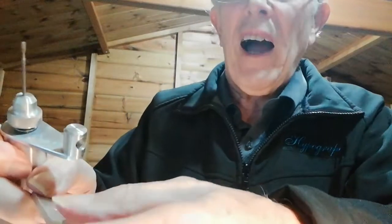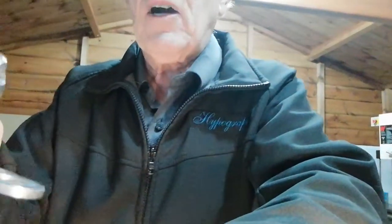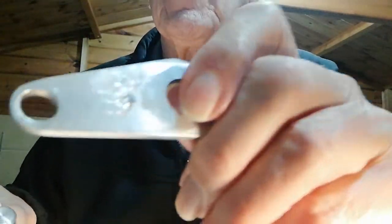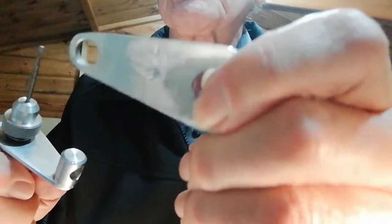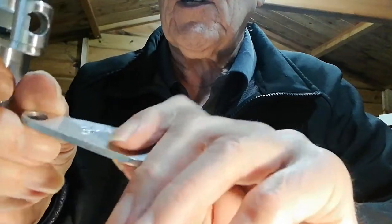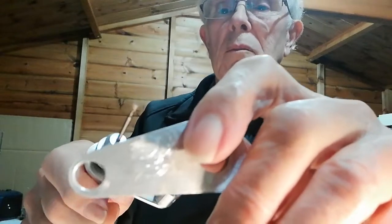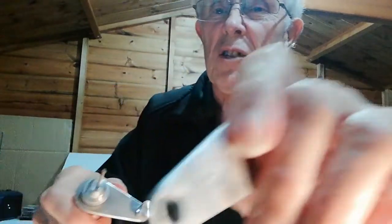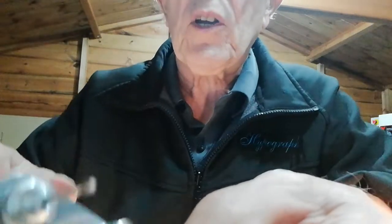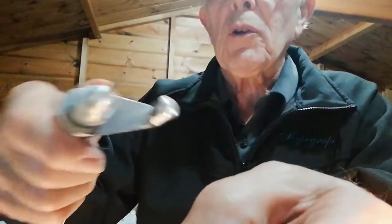If you want to use it as a rotary file on a flat surface for instance, then if you look at this here, there are some marks on that edge there, on that surface. They're sort of just old machining marks and things that were done in the course of machining and they weren't there intentionally — they just got marks and things. But what you can do, if you wanted to get rid of those marks, you can use this rotary file.